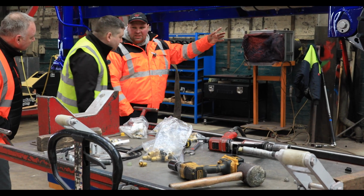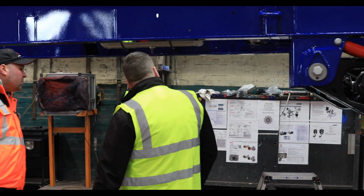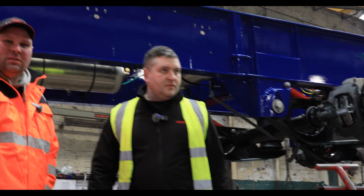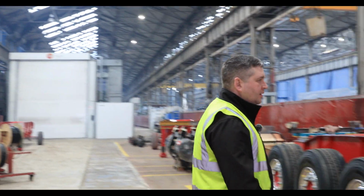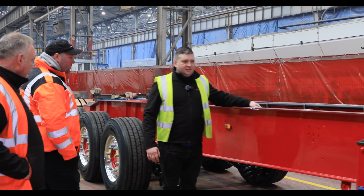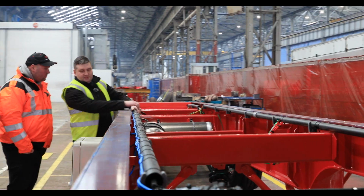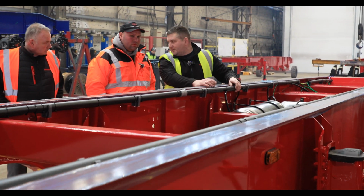Tanks are as well, aren't they? These are the air tanks we looked at in the parts earlier. Yes, so the aluminum ones with the brackets. Very smart. What is very unique for the Fruehauf trailer is the type of installation itself. We put the tubes and cables inside this plastic tube, because that's your brake system. You don't want really any leaks in there.